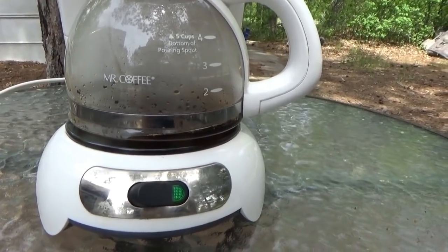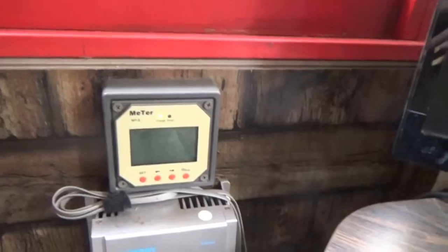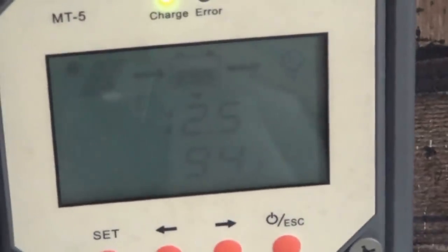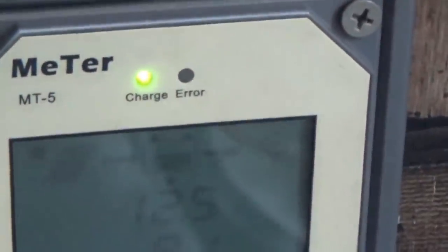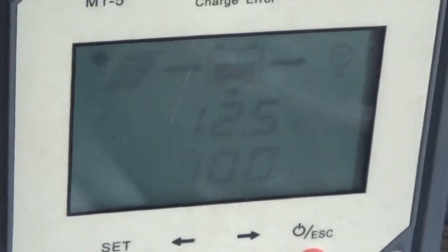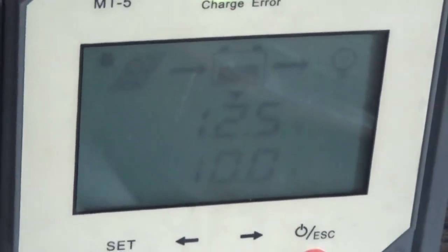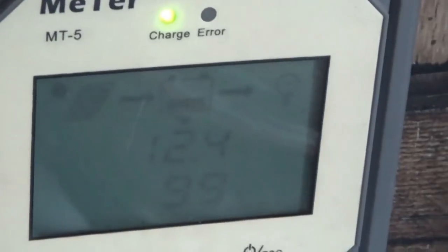Let's go inside and see how many amps and watts we are pulling off the solar panels right now. We dropped down to 12 and a half volts and we are pulling about 10 amps. I have a single 200-watt — sorry, 235-watt panel on that. So we are pulling 10 amps. This is very brief and intermittent usage so it is not going to cause any problems at all on that battery bank.